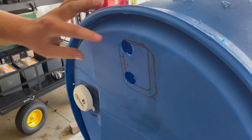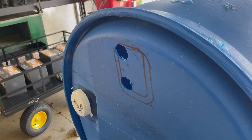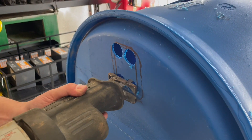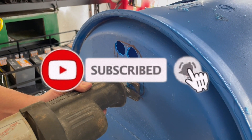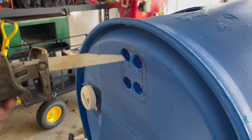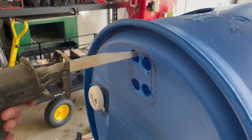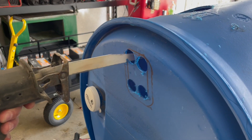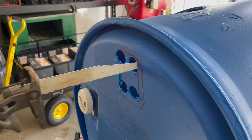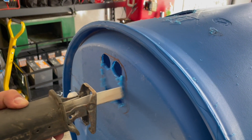I can be sure it pulls together tight with the fitting on the inside and the outside with the gasket in the middle, and doesn't cause any unnecessary leakage. I'd rather it leak at the fitting than at the wall of the barrel. Now I've got out the reciprocating saw — you can use a jigsaw or a little tiny hand saw, anything that will cut this. I'm just connecting the dots at the edge and cutting out this rectangular hole. This hole eventually gets fitted with gutter components, and the water is going to come off the gutter through the top, through the pre-filtration system I'm building, and fill up the barrel.